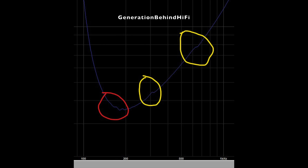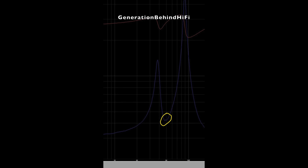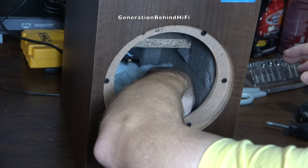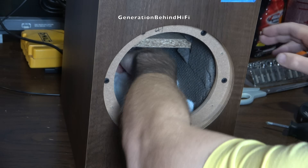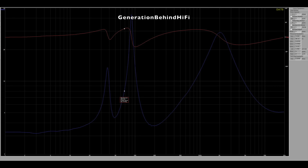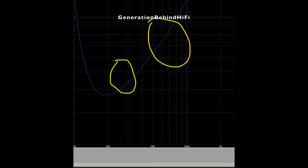Now let's see if all my hard work has paid off. To recap, here's the before picture showing resonances at 300 Hz and between 600 and 700 Hz on the stock Q350 cabinet. After doing the upgrades and performing the sweep again, I noticed a hump at the port tuning, which usually indicates a standing wave. At that time I was also using Sonic Barrier at the base of the cabinet around the crossover, but couldn't cover the entire base effectively. To fix the standing wave, I removed that foam and replaced it with 58 grams of polyfill, which allows much better coverage at the base. After installing the polyfill and re-running the test, it was perfect — the standing wave was gone and the resonances had disappeared.